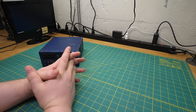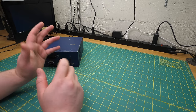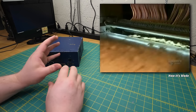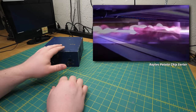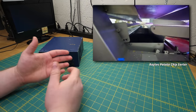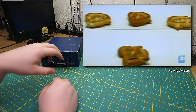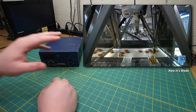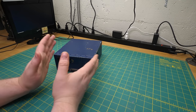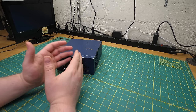But what is this machine vision? I'm not qualified to tell you the full answer because it comes in so many forms. But there's a great example in basically any food-oriented episode of How It's Made. If it's potato chips, once they go through the fryer, there'll be a chamber with a bright light and a camera that takes high-speed photos and sends them to a computer. They're analyzed in software, which compares every chip to a reference image. If one looks burnt or underdone, it's automatically blown into the trash. I also found an episode where a camera locates frozen pretzels on a conveyor belt and uses that to tell a robot arm where to grab them.